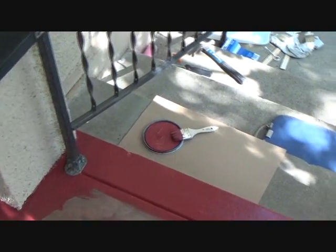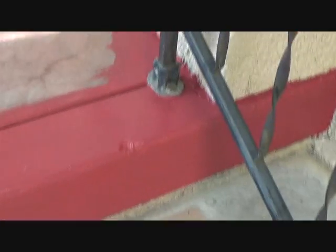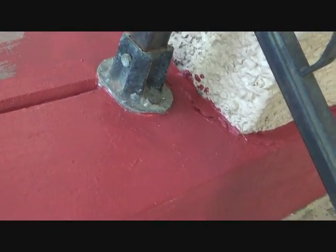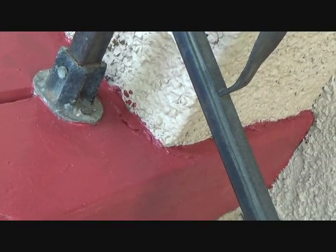See how nice that little groove looks now. I got everything cut in. That was kind of tricky to get around that. I got a little bit of paint right there and instead of wiping it off — which would just smear and get all over the place — I've got some of this tan color inside, so I'm going to just let that dry and touch that up. I got this nicely cut in all the way along there. I ended up using a two-inch throwaway brush. I don't even think I'm going to use the three-inch brush. So now I'm ready to get into the roller.